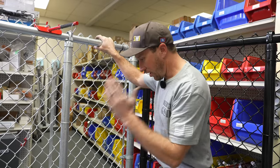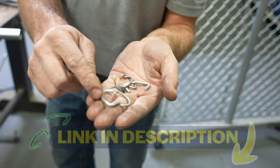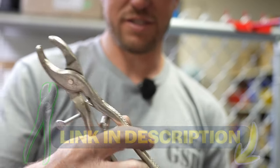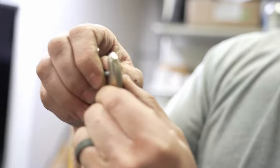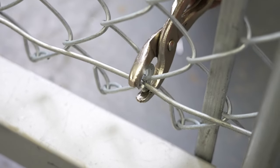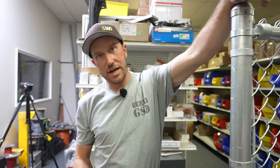The last thing to do is hog ring the tension wire, and just like everything else, it comes in 9 gauge and 11 gauge hog ring. That'd be a commercial setting; that'd be more of a residential setting. For applying the hog ring, we're going to use these bad mamajamas. That spring in there is reversible — right now it is set for pulling it closed. If you flip that spring, you can go open. It has little indents in the pliers themselves that hold the hog ring. I'm going to hook the chain link, hook to the tension wire, and now I'm going to compress it — it's going to close. These hog ring pliers compared to the other ones are so much easier. They have longer extended handles and are far easier to compress a 9 gauge hog ring.